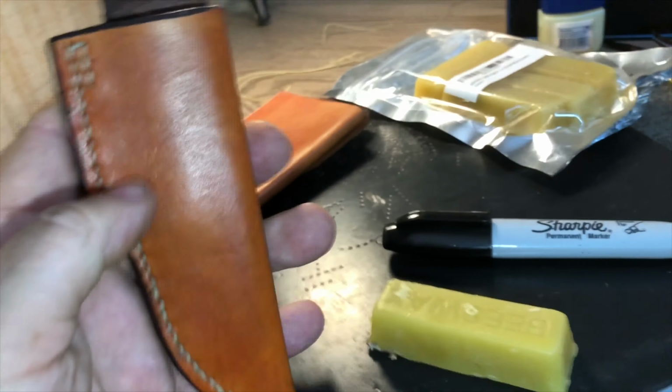I wet it completely so the stain will seep in. This is a water soluble stain here. That's what I use back there. So these gotta dry for a couple of days. I have a fan that I will put on them. What I'll do is lay them down like this and aim the fan at them, and they'll dry out in a couple of days.